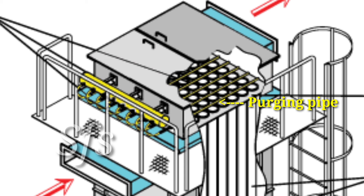The timing of purging can be adjusted. At a time, a single pipeline receives air from the header, so a single row or column of bags is cleaned in a single purging cycle. Each column or row of bags is cleared one by one.